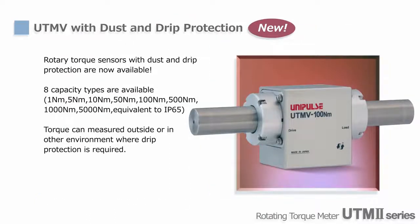Drip-proof type is now available for torque sensors as well. UTM V3 is a new type of rotary torque sensor with robust shaft and dust and drip protection equivalent to IP65 for use in harsh conditions. UTM V3 is available in 8 different capacities ranging from 1 to 5000 Nm to cover a wide variety of applications.